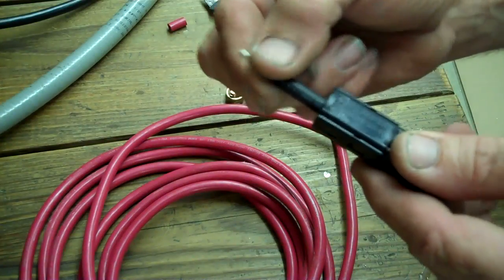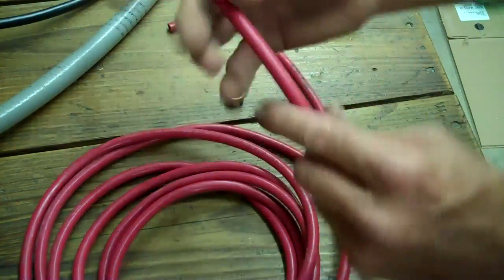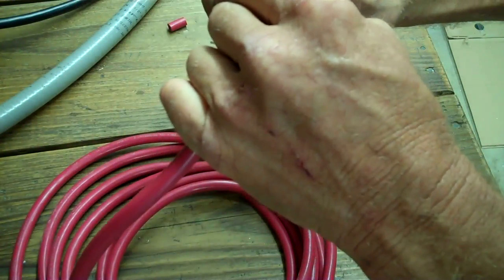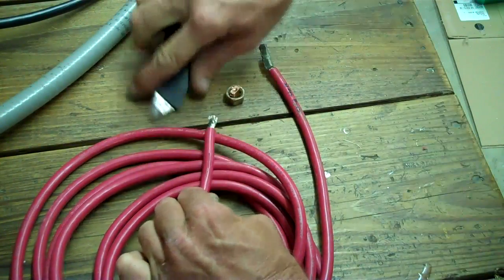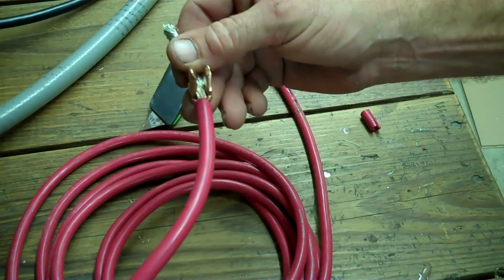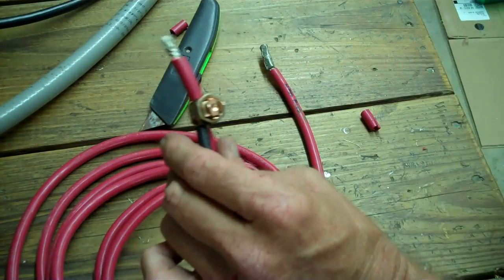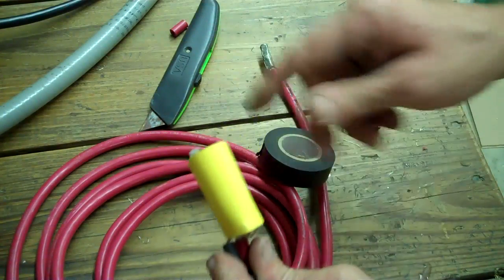Where each wire comes through, I'm going to strip it back pretty long. This is number 10 that comes off the panels, and I'm going to be running it to number 4. I'm going to take a piece of insulation right out of the center. This is boat cable — really nice stuff. The way I'm actually going to make the connection is to use what's called a bug nut or split nut, and all you do is just tighten it down. It's a very good connection. Then I'll wrap it with electrical tape, slide a piece of shrink tube over it, heat it up and shrink it.